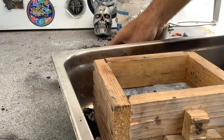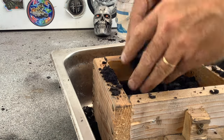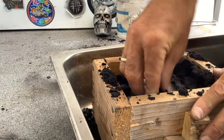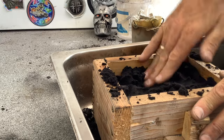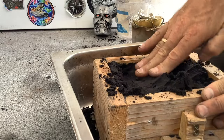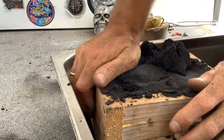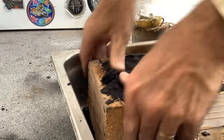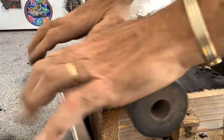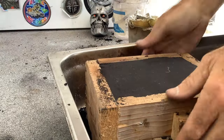Now that the top of the frame's on, I normally sprinkle sand lightly over the piece to try and give it some better detail. Sometimes I use a sift. I have to pack the sand into the mould as tight as I can with my thumbs and my palm of my hand, and then I finish with a rolling pin just to get an even pressure throughout the whole mould.